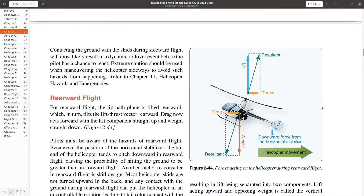Other things you can do with a helicopter: yes, you can try to fly backwards. In a hover you can do this, and it depends somewhat on the helicopter. I like to have this exercise I call the 'windsock of shame' — or the 'cone of shame' if you don't have a windsock — where I make people fly a circle around the windsock while always pointing at it. It sounds easy but it's not. On a really windy day with wind coming from behind, you might not have enough ability in your particular helicopter to fly backwards and keep standing still above the ground.